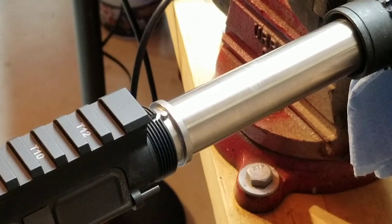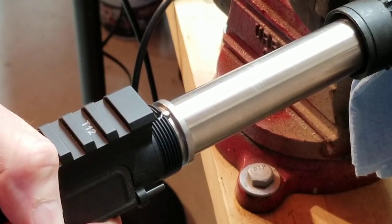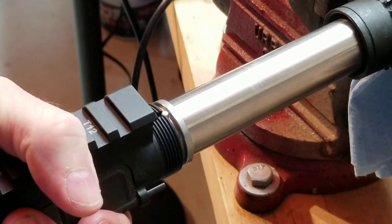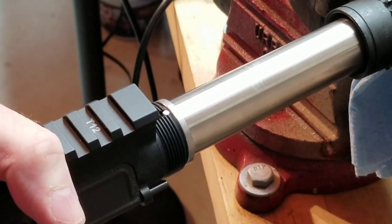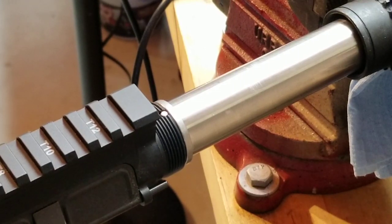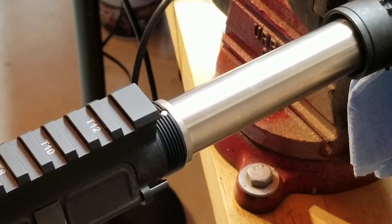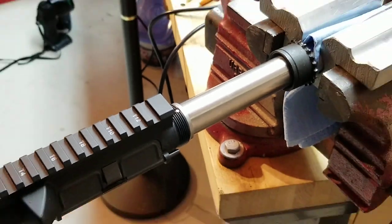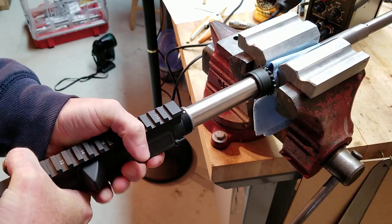You can really see how that is fitting on there good. Just keep going - you have to push it straight because of the index pin - maybe a couple thousandths left and right. That is on there pretty good - that's what you want. You can't just muscle it on. Then what you do is take a piece of wood and a hammer, use the wood as a buffer, and beat it on there. You can see I'm cranking on it pretty good. That would be fine for building - that thing is on there tight, that is not going to move.